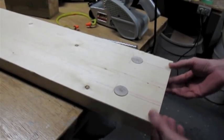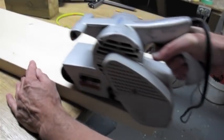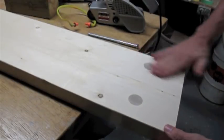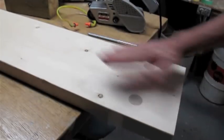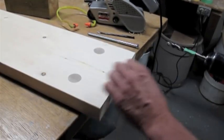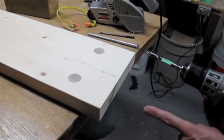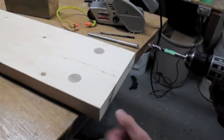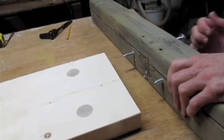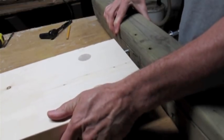Now that the holes are drilled and we're ready to put our posts on, we'll give this a sand job just to get the tops of the dowels down. As you can see, that's sanded down beautifully. Now we'll put our post on. Before we put the post on, we want to drill a 3/8ths hole only about an inch to an inch and a half deep, so that when we start the bolts, they can go in the hole and start themselves off nicely. We'll get our board started and our pilot holes there, and line everything up.